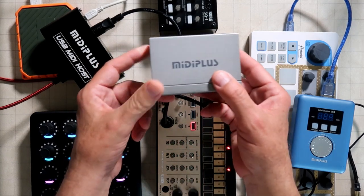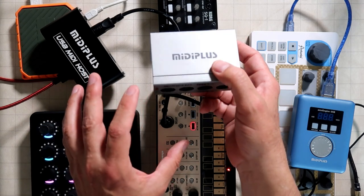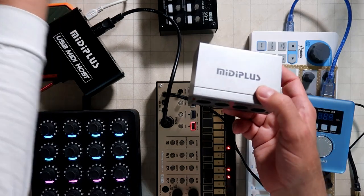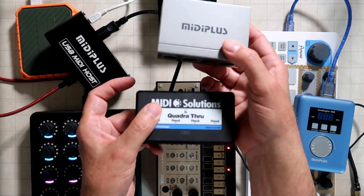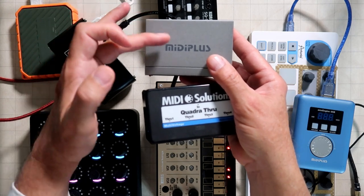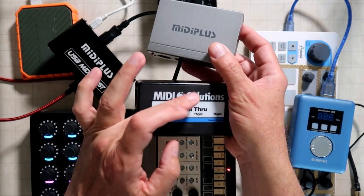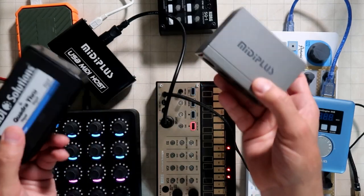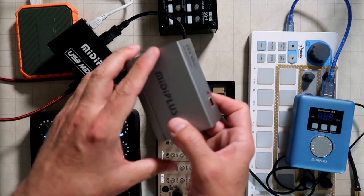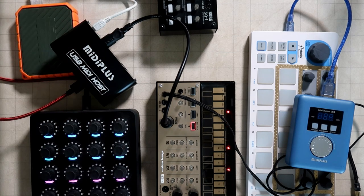This is one of my very favorite little MIDI gadgets: a MIDI 2x2 box, brand is MIDI Plus. It's a USB input, so you hook it to your computer — your DAW, pure data, some coding language, whatever — to enable your computer to talk to a MIDI device via MIDI. On one side, there's an in and an out for side A, and an in and an out for side B. So it lets you go from the computer to this type of MIDI cable very easily. It's a powerful converter, and not very expensive — a great way to have your computer be the thing controlling a set of your gear. You can combine this with the Quadra Thru to send different MIDI channel signals out of one side and then split the channels off — a lot of power from relatively inexpensive boxes.